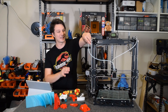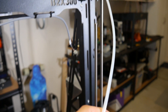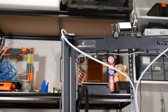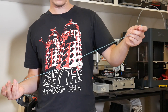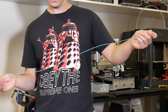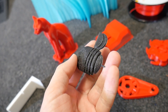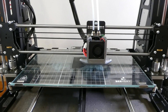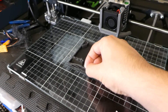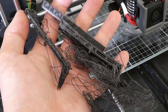These are probably the longest Bowden tubes I've ever seen, and on top of that, this machine takes 1.75mm filament. At any given time, the extruder is pushing material down this thin tube. My first small test prints worked perfectly with no issues using the Cura profile provided. However, once prints started getting more complex and requiring more frequent retractions, they just started failing — again and again they jammed and stopped extruding.